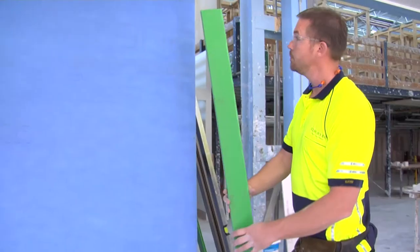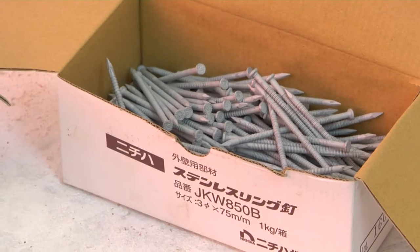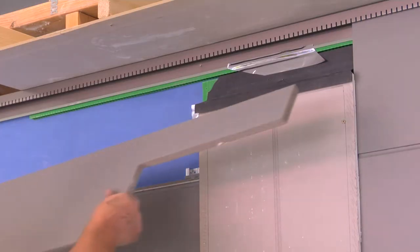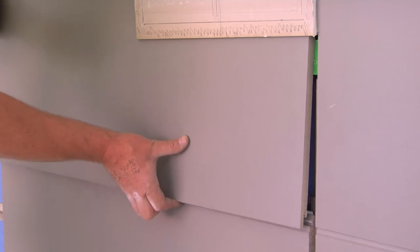These spacers are held in place on the frame using regular nails. Cementel supplies face-fix nails to use where panel clips cannot be used, like for the top panel at the roofline or under and above windows or doors.